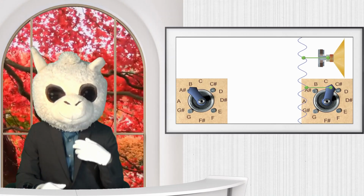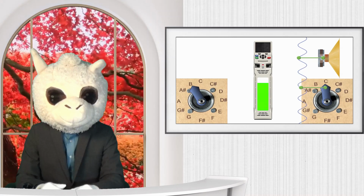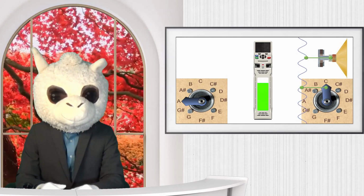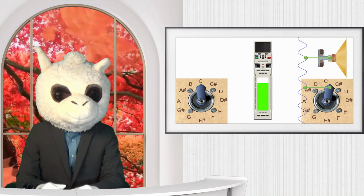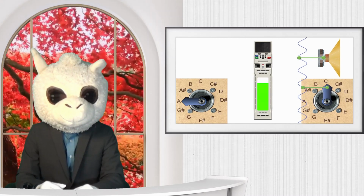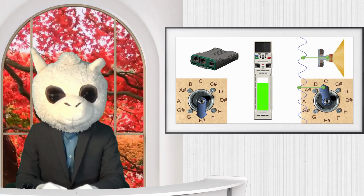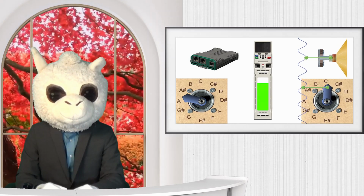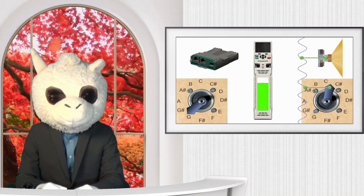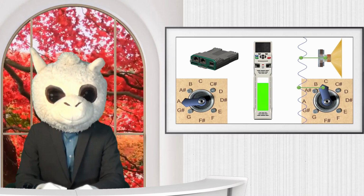Now, the servo controller I'm using today is the M700. It allows me to use the onboard profile that's built into it and add it to a custom profile. Some other servo controllers will allow you to do what we're doing, but you have to write everything from scratch. With this one, we only have to write the music portion in Codesys. So we're going to put the Codesys in the MCI 210 module, and we're going to have it sum the onboard profile to the music profile and output it to the motor. I'm not going to show you how to do that today, but I will in a future video.